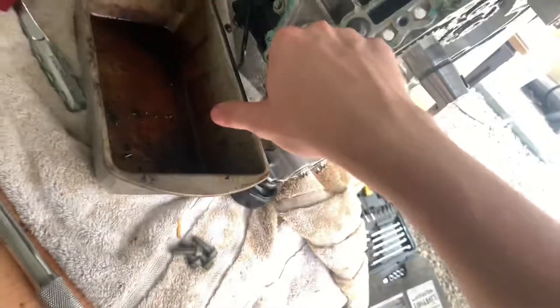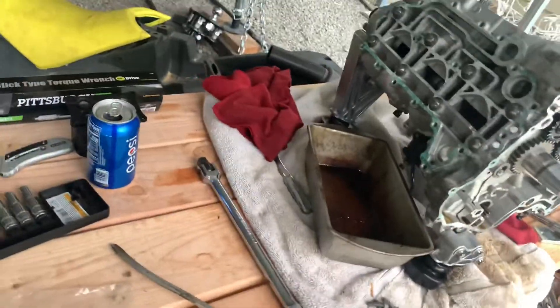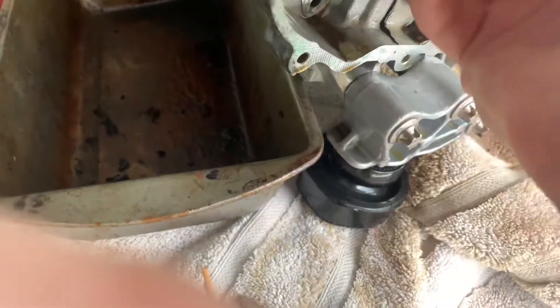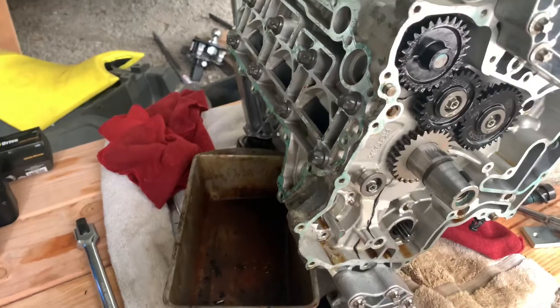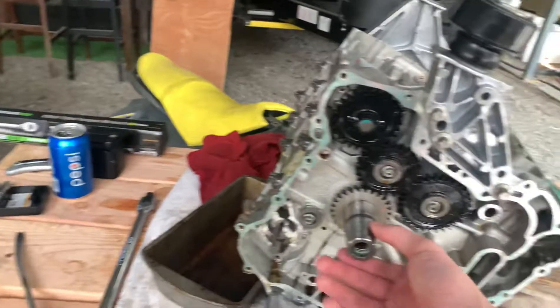Right here through here, I'm pretty sure a filter sat. It was the part that was covered — I'm pretty sure it was this part of the filter right here — and it sucked in a piece of the broken gear. Once that broken piece of gear came in, it probably locked this up a little bit and shredded the gear even more. But the engine is still fine — it only ran without an oil pump for not that long and in limp mode, so nothing looks worn out.